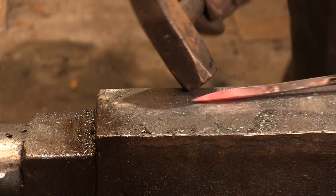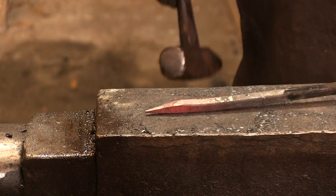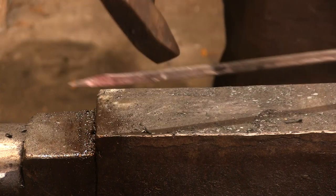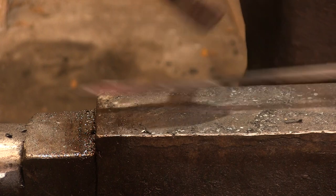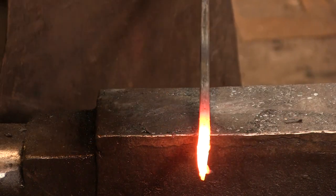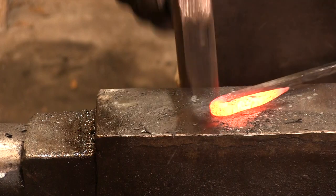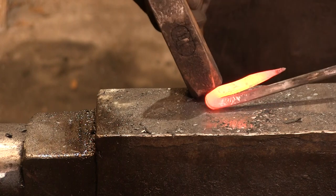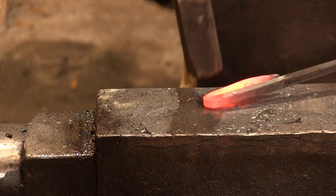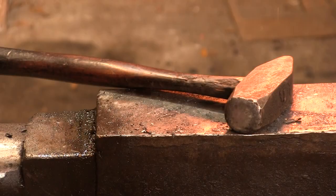I'm going to take another heat and at about two and a half to three inches in, I'm going to fold this back over onto itself. Pay attention to which side your handle is facing down, because when you bend this you want to bend it down in line with the hook of your handle. If you don't do this, at some later point you're going to have to make a twist in the shank to line it back up and pretend like that's what you meant to do all along. Fold it over the edge of the anvil, bring it back onto itself, leave a little gap so you can get your flux down in there, and then we're going to fuse about an inch of this together and draw it out into a point.